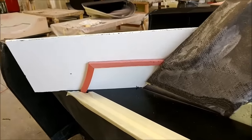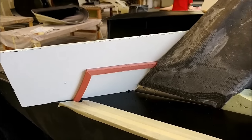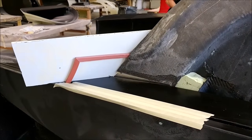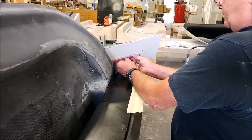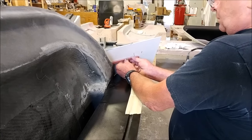Back on the roof mold — Mark was busy putting the silicone rubber profile in place for the vacuum bag channel. The idea is to make the channels from the roof mold meet up with the channel from the door insert, and he's just holding that while the glue dries.